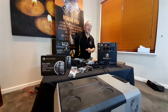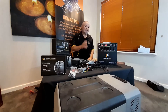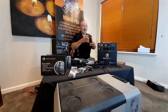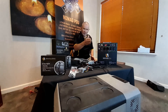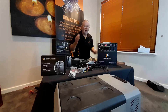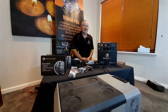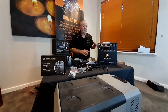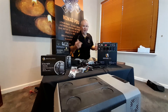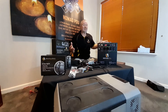Running for 12 hours in that heat at 5 to 7 amps — that's 60 to 80 amp hours — means you'll be pretty much done in about 20 hours, because overnight it draws less. It doesn't matter how big the battery is; the same mathematical limitations apply. To work out how long your fridge will run on any power source, understand your fridge first. Do a dry run before you go away: fill it up, run it at your intended temperature, and work out the power draw. Then calculate how much power you need in your power source to make sure your fridge never runs out.